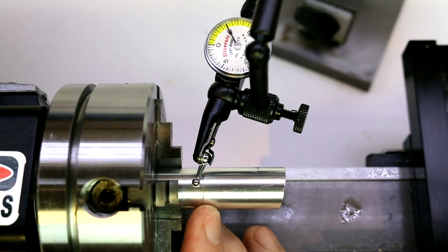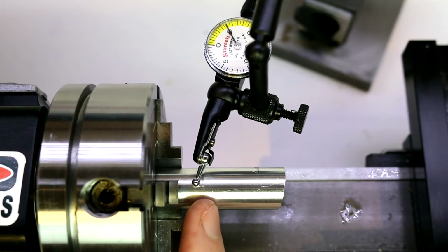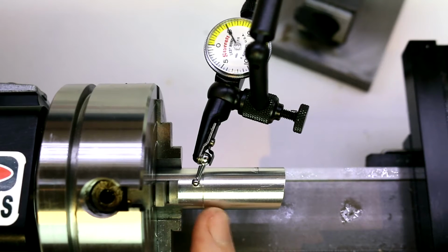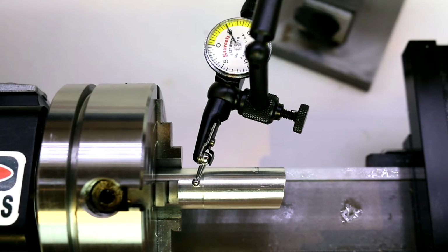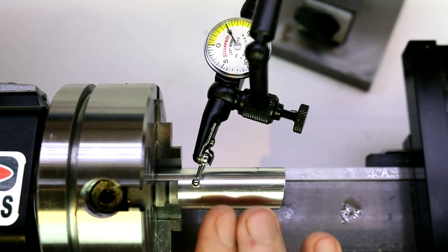particularly as hobbyists, we'll want to get accuracy down to that 1/1000th or 1/2 thousandth, or sometimes even more if we're particularly obsessive compulsive about it. You really don't need that in most cases, right? All parts, when you manufacture them on a blueprint, they'll typically show what their tolerance is. Sometimes that tolerance is 10 thousandths or 20 thousandths. So, you know, always getting down to where you're within a thousandth or 2 or 3 or half a thousandth really isn't necessary on the majority of pieces you're going to work on.